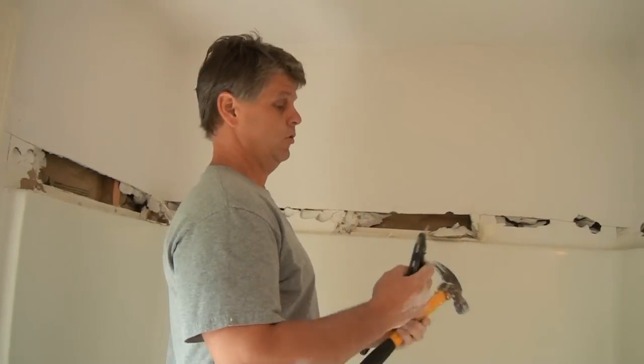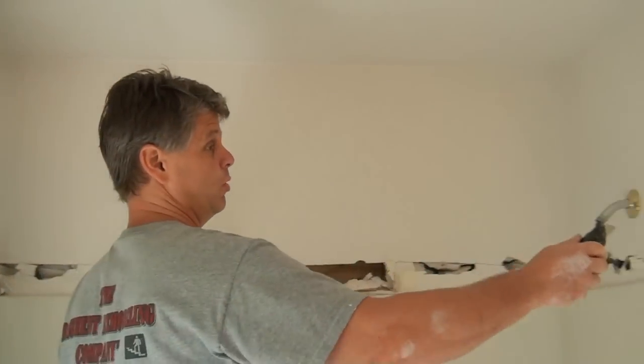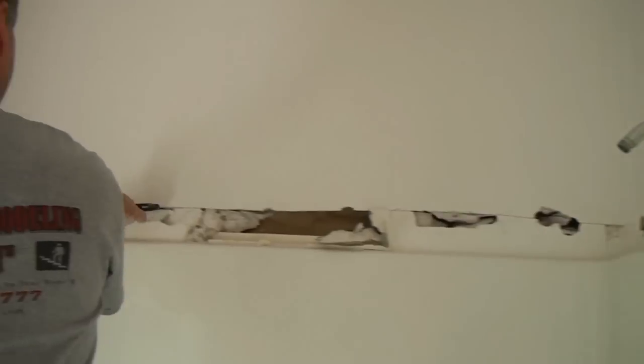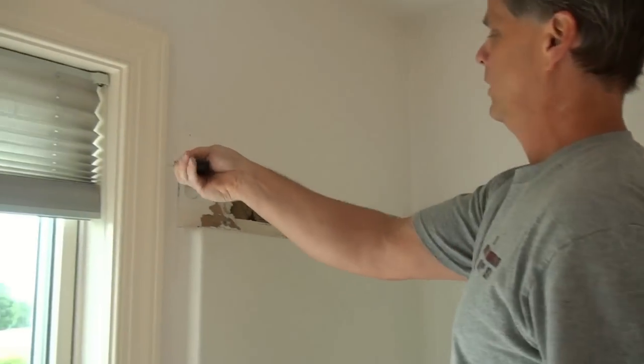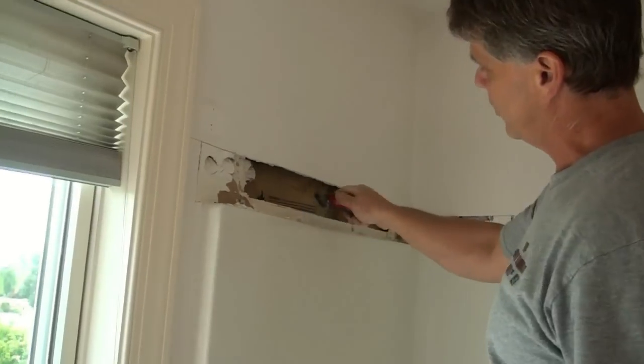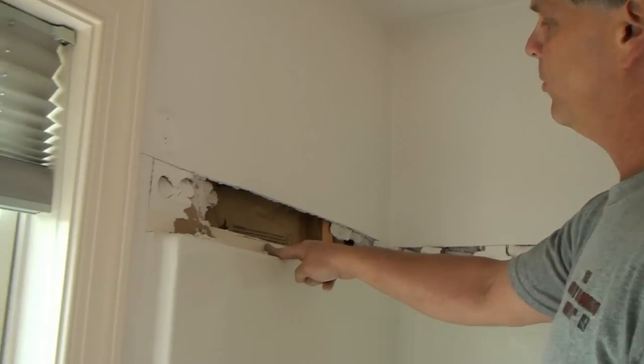What I'm getting ready to do now is tear the tub out. What I did was take my regular utility blade and go around the top of the tub about two to three inches off the top and cut around there with my blade. I'm exposing this right here — this is the flange to the tub unit.